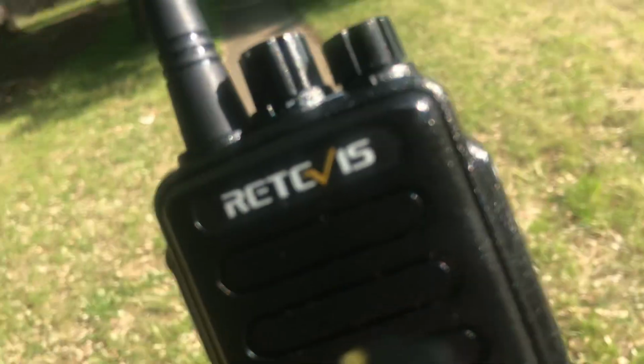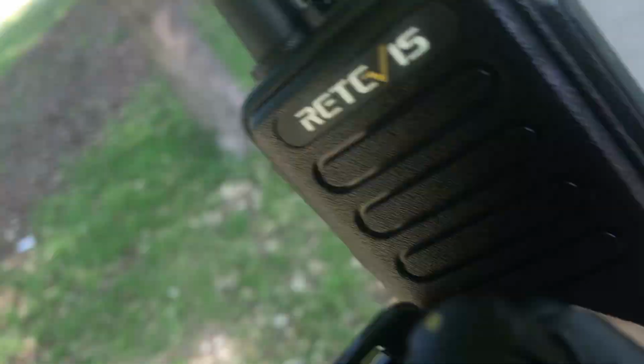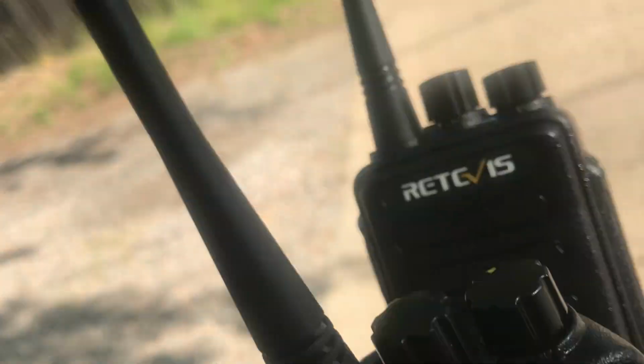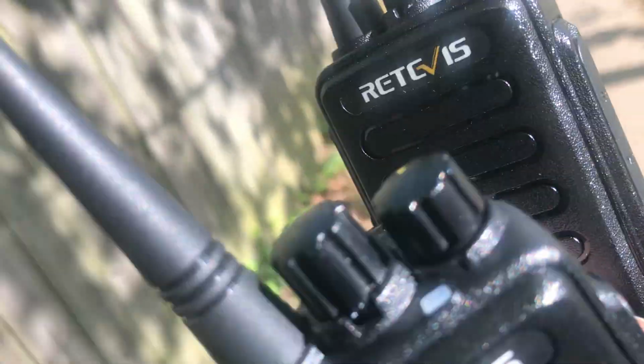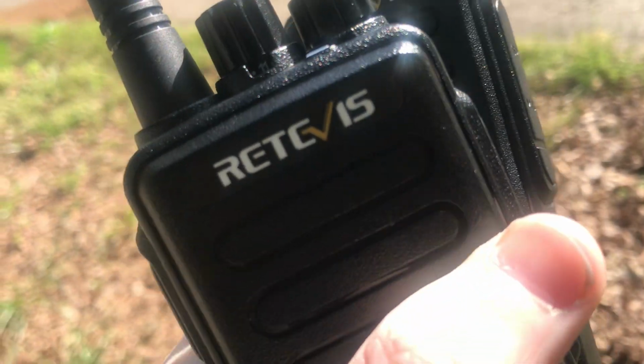So, if you're tuned to, say, 27385 LSB, but instead you put your radio in upper sideband and you tune it to 27.287.7, it kind of sounds like Donald Duck after he smoked some meth and inhaled some helium. Completely unintelligible, no matter how much you tune it in. But switching the sidebands fixes the problem because the signal is inverted. It's a pretty good way of explaining how speech inversion scrambling works.